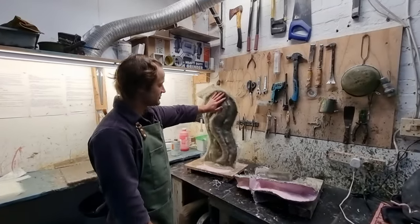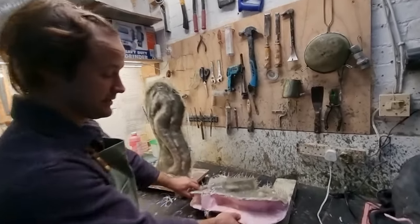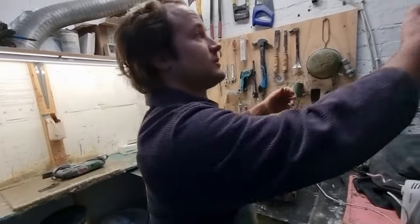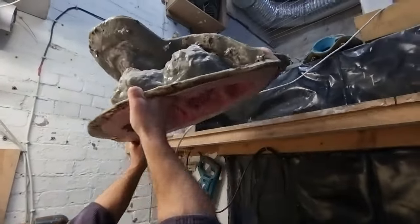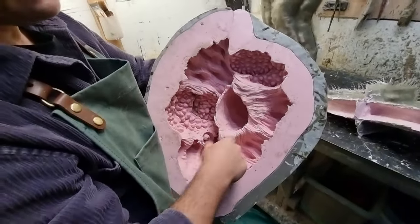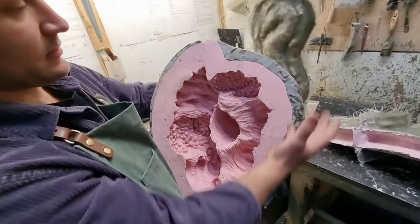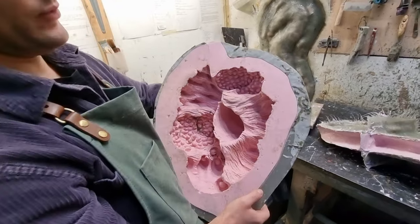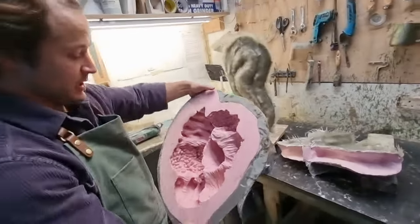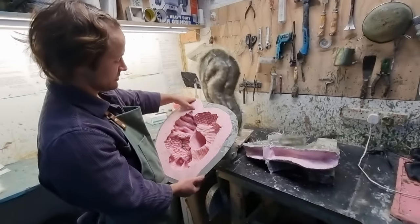These are the moulds of the new sculptures — this is fibreglass, and underneath the pink stuff is the silicone. The silicone is soft and takes a very detailed imprint of the sculpture. This is a moray eel sculpture in the negative. We have elements of the coral and this is all the negative imprint. If I paint it with wax and then pull it out from the mould, it will be a hollow wax version of the original sculpture. How many casts can you get before it breaks? Probably a few hundred casts if you do it well and keep the chemicals right.